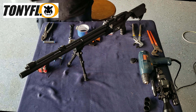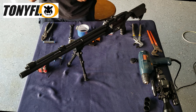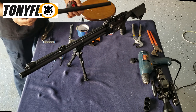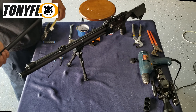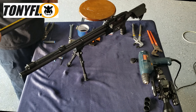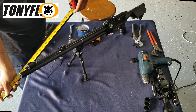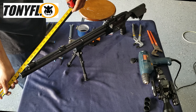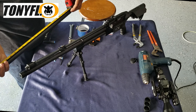I'm going to measure from the front end of the shroud — since I scuffed up the back end — and get my 20 and three quarter inch measurement. The shroud actually measures 23 and a quarter inches total. So I'll be cutting off approximately 2.5 inches from the back.